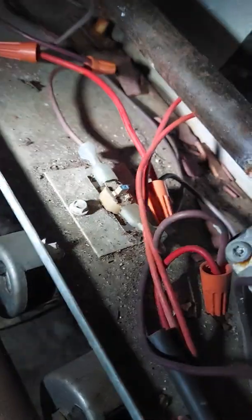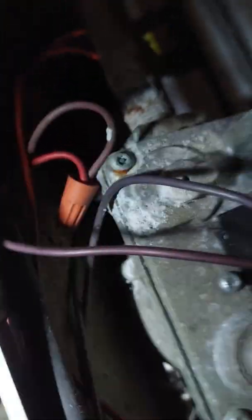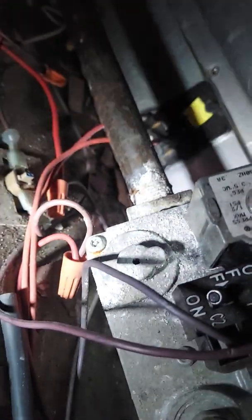Put the cover back on. Then the inducer motor came back on. Once the switch was closed by the door being closed, it heated up to operating temperature. Once it did, the gas valve turned on, started putting the flame out, and shortly after that the blower kicked on.